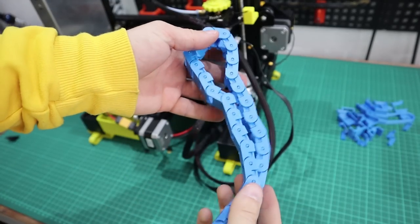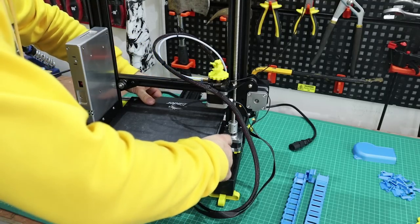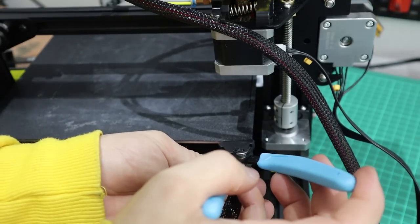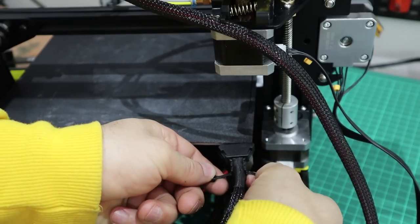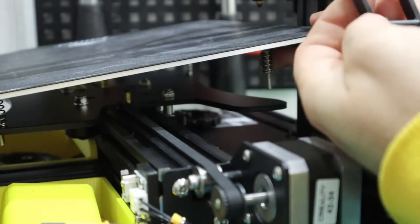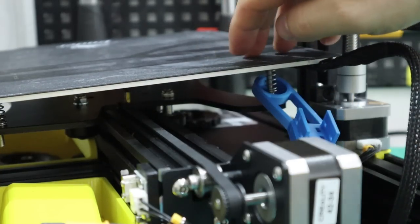This cable chain is absolutely epic. I did have a few issues breaking parts while assembling it, but I'll explain how I overcame that towards the end of the video. Take off all four bed leveling screws — this is the first part you put on. Carefully cut off the cable tie that attaches the shroud around the heated bed wire, then take off the black cap at the top. Gently lift the bed up, pull out the bracket, and replace it with the one you printed. Use one finger to hold the spring in place so it doesn't fall off.